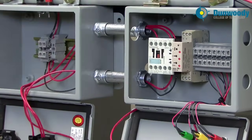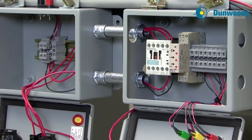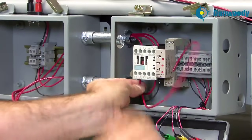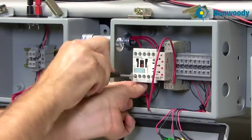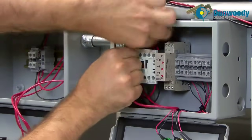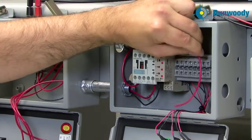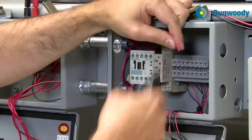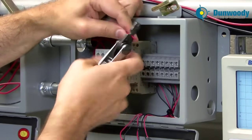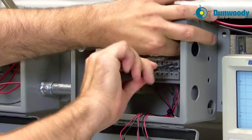We need to come out of there and get over to the buzzer. The buzzer is way over here so we'll strip a wire and come out of T1. Tighten it up, give it a pull test. In this case I'm going to go up and around, trying to keep my wiring neat. This is the one wire that's going to run a little crazy — it's going to go over to my buzzer on the far end. The terminals are color coded so they make sense. The red and black on the end is going to be my buzzer. If I wasn't sure I could always take a meter and do a quick continuity check to confirm it's the buzzer.